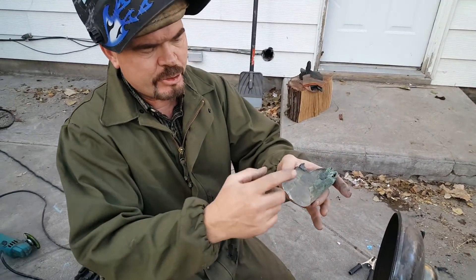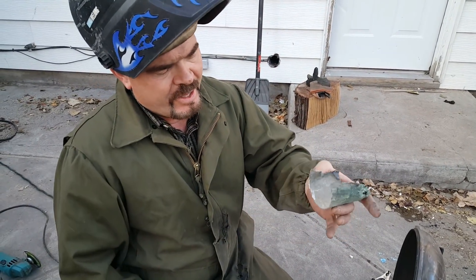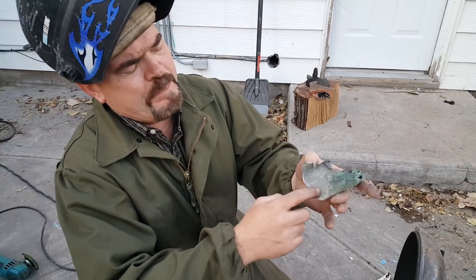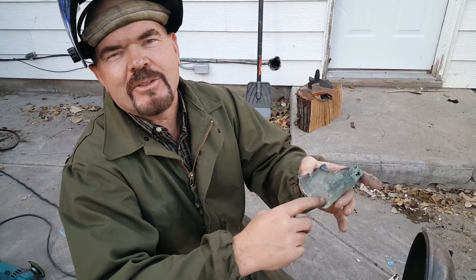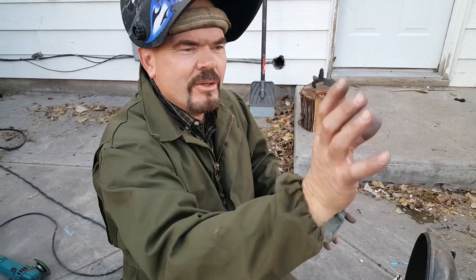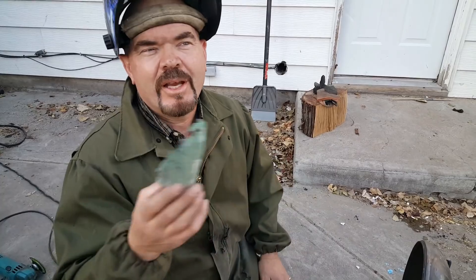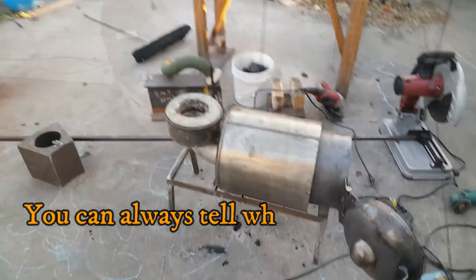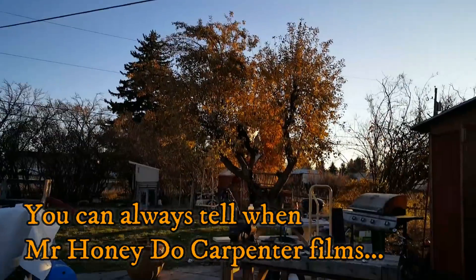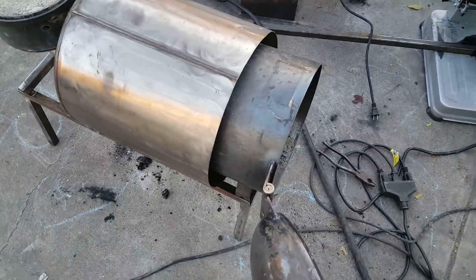When I got down to the bottom — the very bottom inside — it was not melted. The tube was not melted except for the top portion and up after that. That just gives you an idea that it was just barely less than 1220 degrees right there at the bottom. As it went up it was less than 1220 degrees, and at the top where the extra oxygen gets put in, it was super hot and all that just melted right down and turned into molten aluminum.